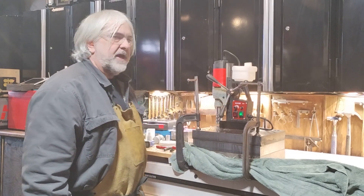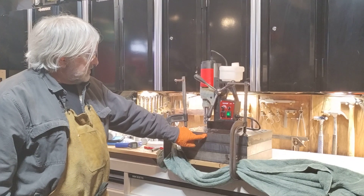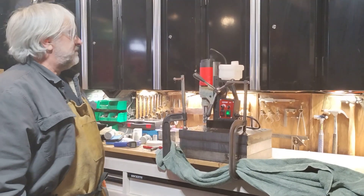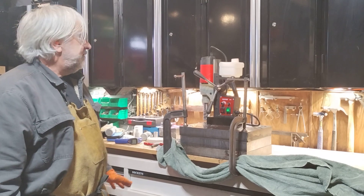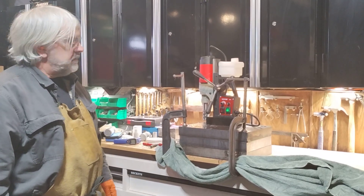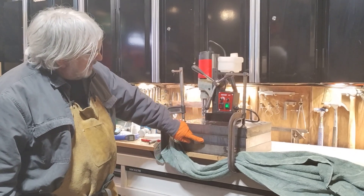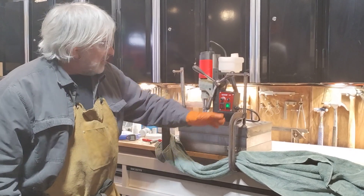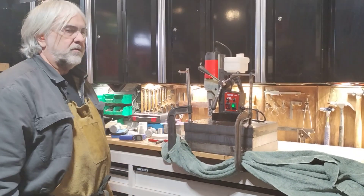Demonstrating a V-bore 40H annular cutter. I'm cutting through pieces of two-inch thick steel. These are going to be pressed plates for a hundred-ton hydraulic forge, and I really need the holes to be perfectly lined up. The idea is to cut through one and about halfway into the other one, slide it off, and then use the existing hole to line up the next set of holes as they go through.